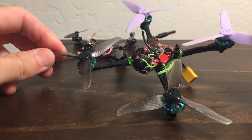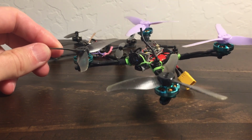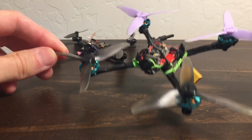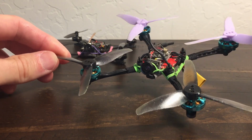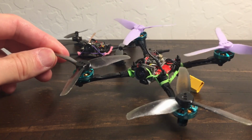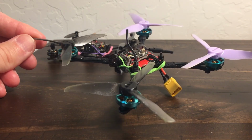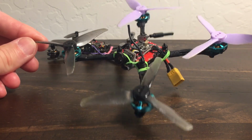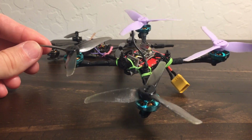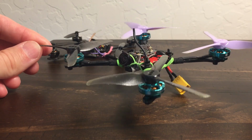But what I think is, if you have a bunch of 450 milliamp batteries, then you probably want to do JESC 48 kilohertz on this. If you're buying a bunch of the 600s and you like a real sharp feel, you're probably better off with 24 kilohertz. However, if you're cruising and just want to fly for a long time and you don't care about how sharp it is, then probably 48 kilohertz. I think you still pick up a little flight time.